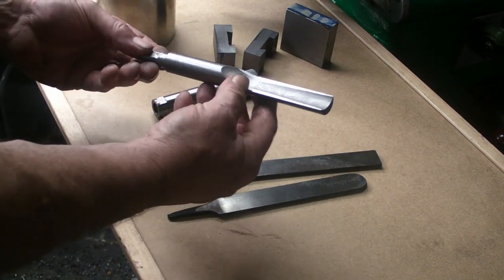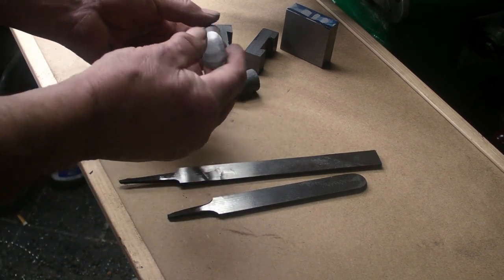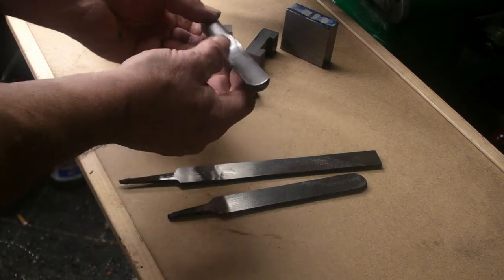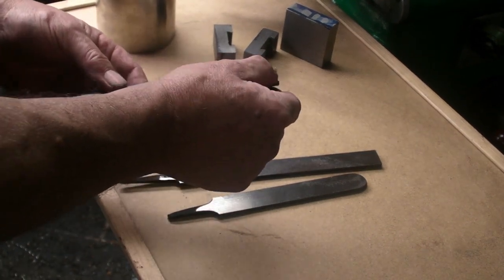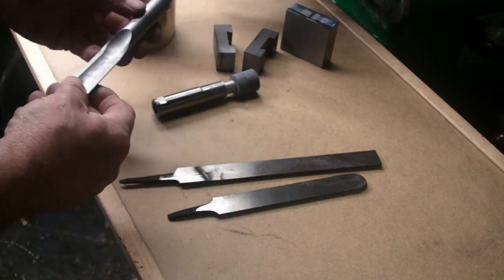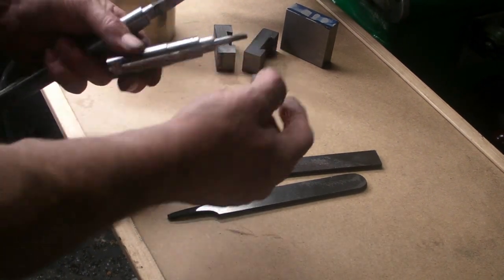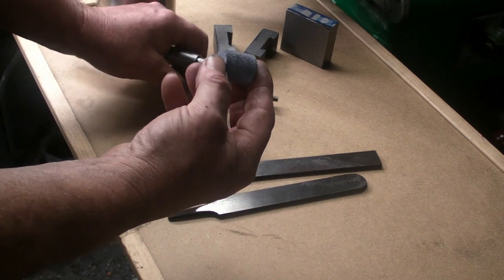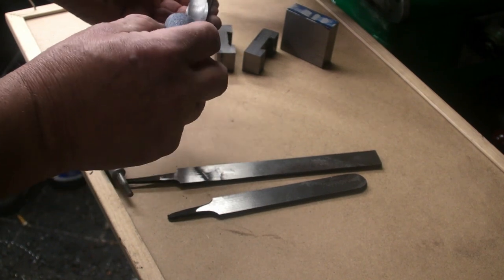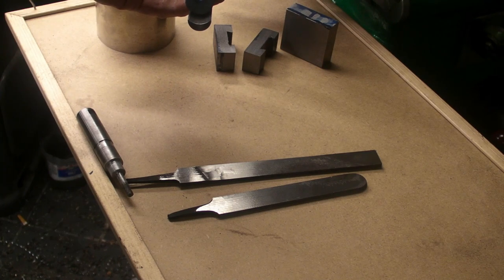The spindle gouge out of that bar. This is where we're at the moment. I've got most of the dish cut out on the horizontal mill with a half round milling cutter. Once I've hardened it, the intention is I'm going to go down with this. I made an arbor for this small grinding wheel, and the intention is just to go down the side of it once that's finished.